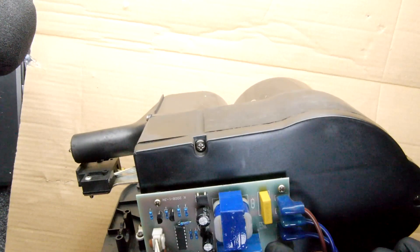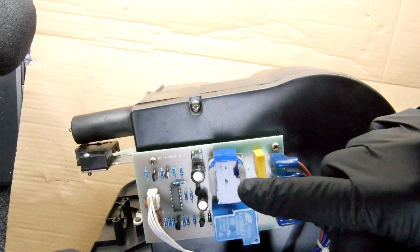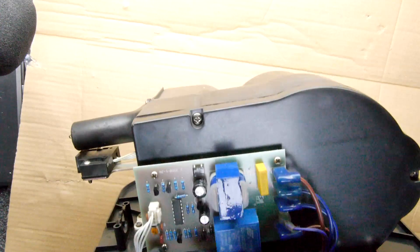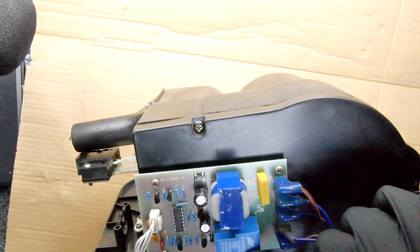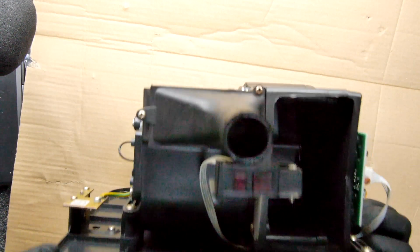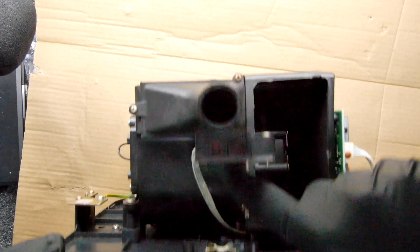You have here a circuit board, probably to operate the timer circuitry. You can see a transformer here, a small adjuster — I imagine that's for setting the time — a chip which has been anonymized, and a relay. So you're basically just switching this relay. There will be an interesting thing, and there is the interesting thing: the infrared detector. That's coming in on these four wires, and that's what sets this thing on and off.